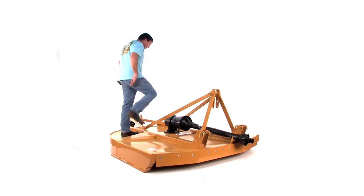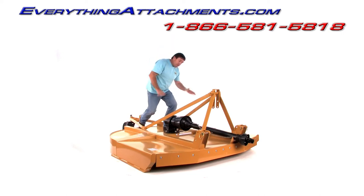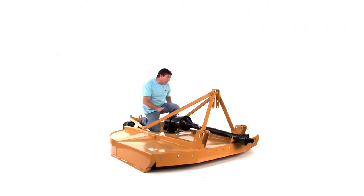All the six-foot cutters — because a lot of the tractors in this size that'll be using a six-foot cutter will have independent PTO, and like the older Fords, when you engage them, they engage really hard. You've got so much rotating mass here that instead of just starting the blades immediately, it would pop a pin. So if you had a shear bolt and engaged your PTO, it would simply just pop the pin. So we've gone with only a slip clutch on the six-foot cutter, because when you engage an independent PTO and it engages really hard, it's going to slip the clutch a little bit while it brings the blades up to speed — it ain't going to hurt anything. You'll never know it happened. Especially with these four-inch-wide blades, you've just got so much mass here.